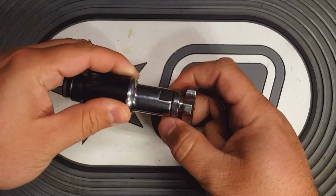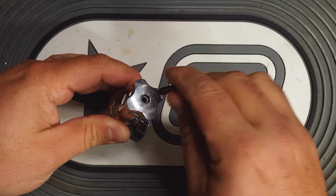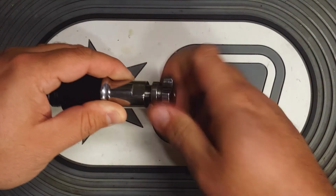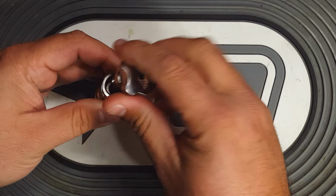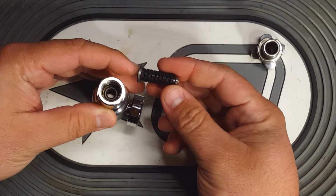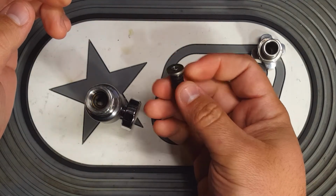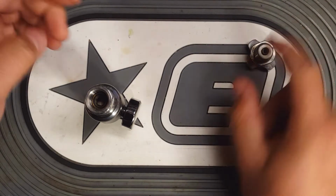If your ring is locked, use a crescent wrench to unlock this. If this is stuck, you can use a 3/16 wrench on the bottom to loosen it up and unscrew the bottom cap, which is your pressure adjustment screw. This comes off, set it aside. Inside you will have your spring pack, which is a Belleville spring pack, but it's all contained on this little rod and washer, so you shouldn't have any issues losing the springs. You can basically just set that inside your adjuster.